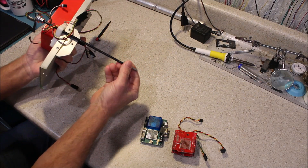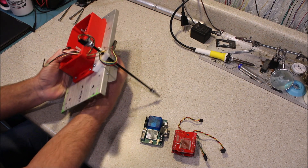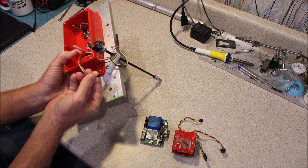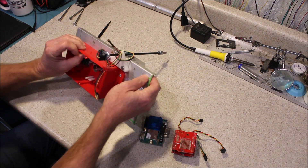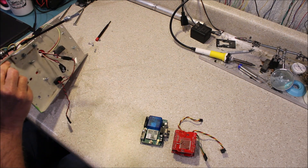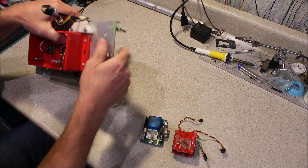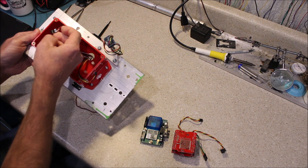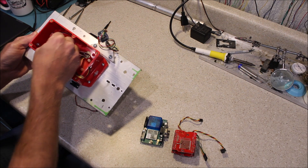We'll start with the top deck here. Taking a look at the compass mast, we can trace the I-squared-C cable that comes up through the bottom hole in the panel and terminates in this tiny little four-conductor connector here. This one is labeled VN, so the other side of this is going to come around to this power switch here, and that goes to its own six-volt power supply to supply full six volts to the servo bus on our servo controller. And this is labeled S channel one, so that's going to be the steering output from our servo controller.